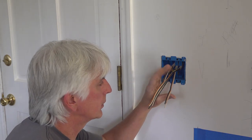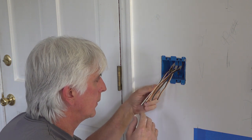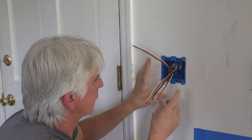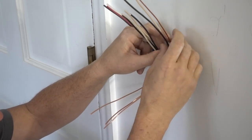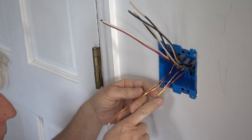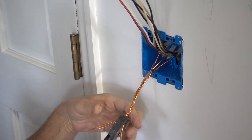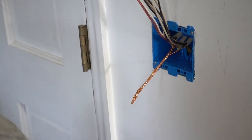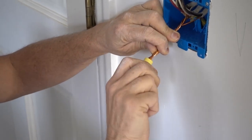First off, I'd like to say watching this doesn't make you an electrician. This is one instance — there are so many ways things can be wired, especially in an old house. We're going to show you how to hook this three-way up the modern, conventional way. There are multiple ways it could be done, and this is the most correct way by code. I've bent all my wires up. Don't think you're an electrician just because you learned how to do this — you need to do some studying and look these things up before you try to be an electrician. You've got to know your limitations. I'll pull my grounds down first and twist them together all the way so there's good ground contact throughout. Because more than likely, you're never going to pull this apart. Put a wire nut on there that's appropriate for the number of wires and size of wire.